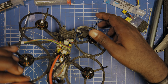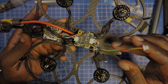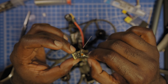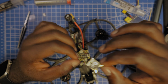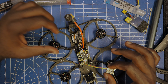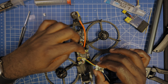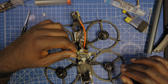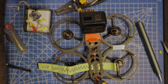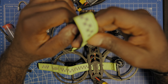That looks perfect. I already put some conformal coating on the Drone Tag module. Now I'll let it cure and in the meantime plug everything in. Basically everything is done — we just need to give it a test, place it somewhere safe, apply more coating, put everything back together, and do some Betaflight configuration. This drone is now fully Remote ID compliant.